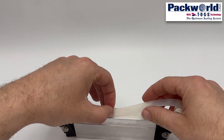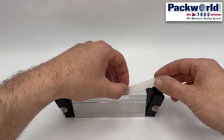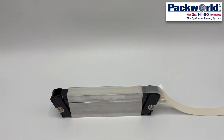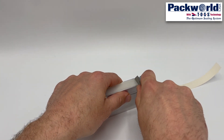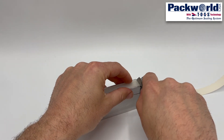It is important to not stretch or squish the silicone when installing it into the groove. Once the silicone is installed in the channel, do not press on it to adhere it more firmly — this action may create peaks and valleys in the silicone layer, which may undermine the conformance properties of the silicone. Excess insulation layer material can be trimmed and removed.